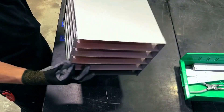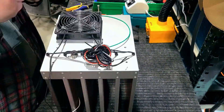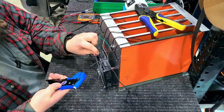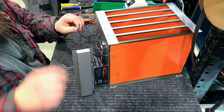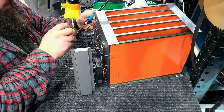As a fun fact, you can actually freeze dry at 32 degrees Fahrenheit, which is pretty interesting. We've also added a fan in the back of the heat rack to help circulate both cold and hot air. The fan obviously doesn't work under vacuum, but it does help circulate cold air during the refrigeration cycle and hot air during the defrost cycle.